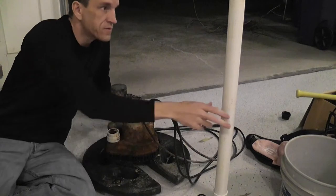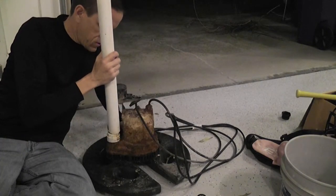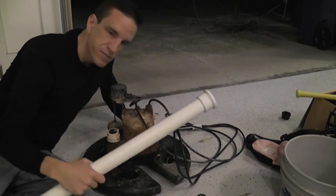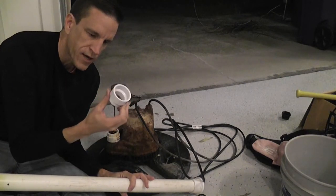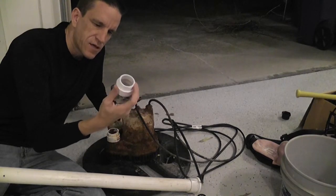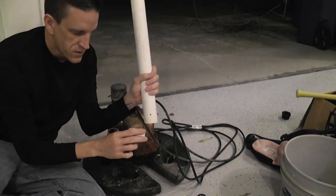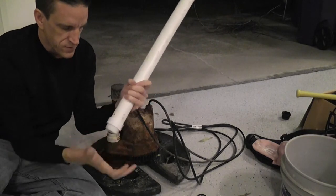Here's the old pump. I tried to bust the PVC fitting off but it wouldn't come, so I just used a saw and cut it right at the bottom. That left me with a stub, so I had to go back to Menards and pick up an adapter — a one-and-a-half inch adapter with threads on one side that fits the base of the sump pump. This piece is going to screw in, and then we needed to get some PVC primer and glue to put it all together.